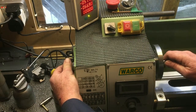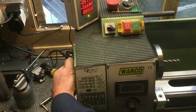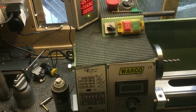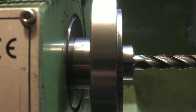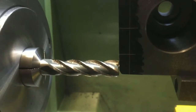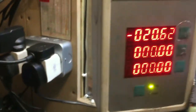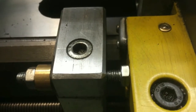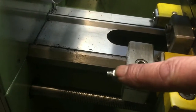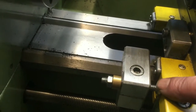Fitting my cutter — not any further than the parallel part; I don't want the flutes going inside the collet. I'll tighten that up with a 19mm spanner and that's the cutter fitted. I've now set my cutter up in the headstock and it's well clamped. I've brought my carriage forward until the cutter touches the surface of the block and then set my DRO to zero. I've also set my carriage lock to the same spot — there's a lock nut on one side and a thread through the centre — so by screwing it further in I can have a definite stop position for my cut, and I'll keep an eye on it on the DRO.